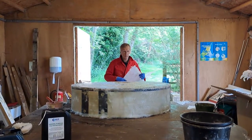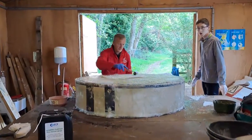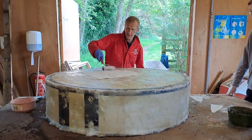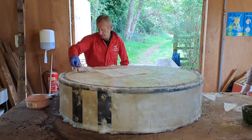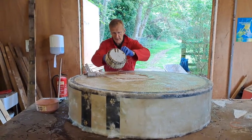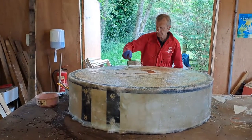We've put a layer of fiberglass and now we're adding another layer. This fiberglass is used for yachts and all sorts. Using a ribbed roller, I'm working around the outside and then putting a little bit in the middle to get that area covered. I'm pouring a bit around the outside — I can either use a brush to stipple it on or use this tool, though it's getting a bit gunked up now.